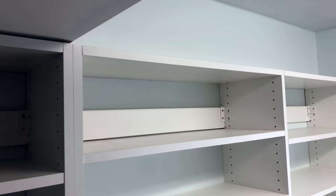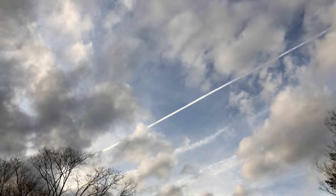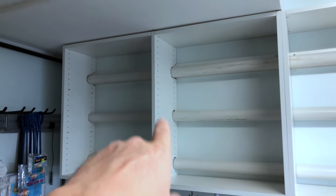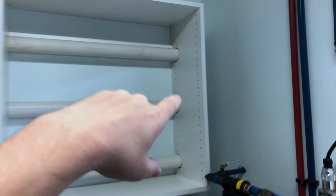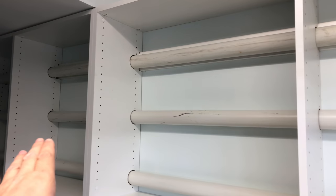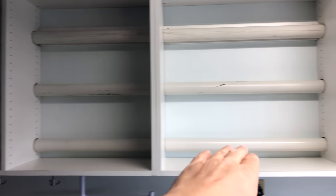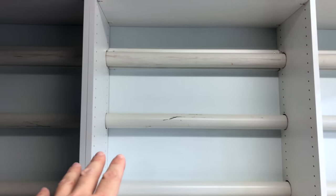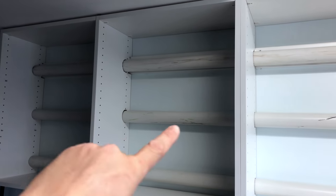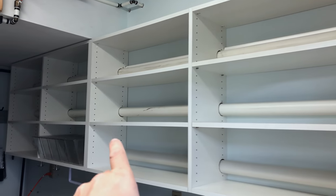That's done and I left everything in order so I can put it back up easier. It wasn't easy, but I got the pipes in — these will be the drain lines. I still have to add the one up top; I do have it at the end where they all connect and come down. I ended up sliding these through instead of notching them out — way easier production-wise and tool-wise. I don't think I'll even need the two-by-fours because these are holding themselves up solid and there's not going to be that much water going through them. For the out drain I am using two-inch PVC.